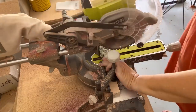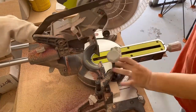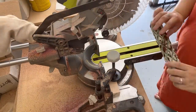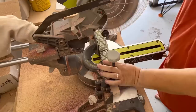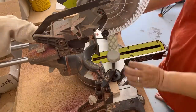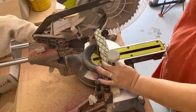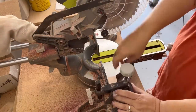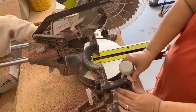I have these old spindles from a table leg — I have four of them, and I'm going to use my chop saw to cut them down. I'm going to get all three sets of legs out of this — I have three cutting boards and three sets of legs to cut. I'm using a stop block for the length measurements so that each of my legs is automatically the same length to keep my bench from being wobbly.